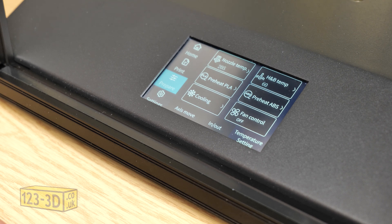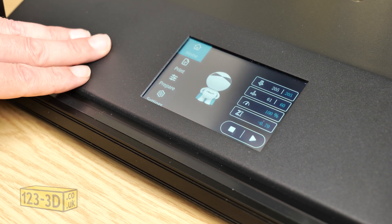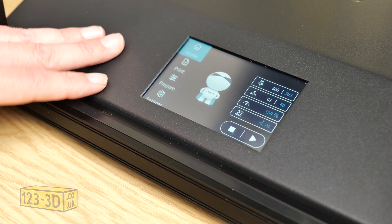This is important because heat makes things expand. So if we did it when it was cold, we'd probably end up with the nozzle being far too close to the bed, giving us poor print results. We'll just press the home button just to see what temperature we're at. And as you can see, we've reached the operating temperature.